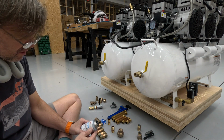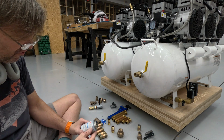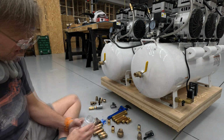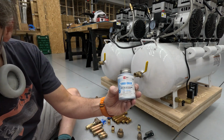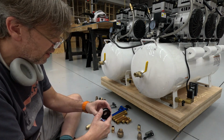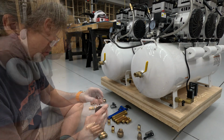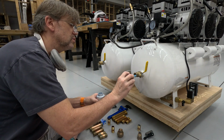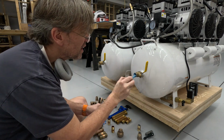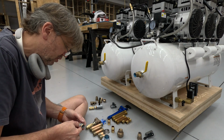True Blue pipe sealant, vibration resistant, contains PTFE, fast dry, flexible set, lead free for plastic and metal pipe. So female applications will get the True Blue. The tape applications, the male applications, are going to get this tape. I've actually never used tape. Very similar to what we just were using. I like its consistency better though. We're going to start with this test.